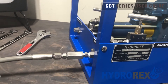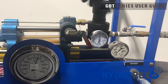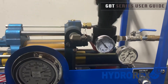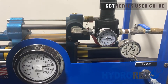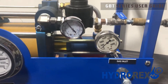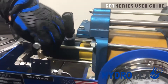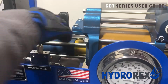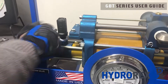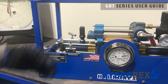I will be checking with soap and water just to see if we don't see any bubbles. We reached our 8000 psi with 80 psi of air and 300 psi of gas inlet, and we'll be closing our isolation valve. We have the requirement for it to sit 15 minutes with a zero drop.